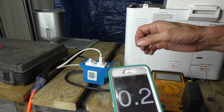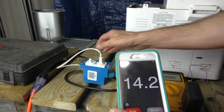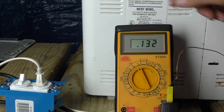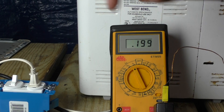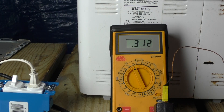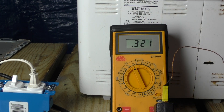Let's hit the power. Just keep doing that over and over again until this thing gets up to temperature. We're up to 132 without anything melting. We've got up to 200 degrees, and I'm extending the pulse width modulation from 15 to 25 seconds on, 5 seconds off. 300 degrees! Let's keep it going. Now I'm noticing the higher the temperature gets, the faster it cools off when I hit the 5-seconds-off stage.